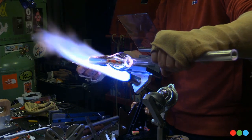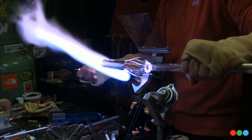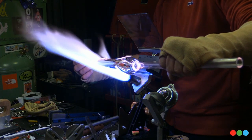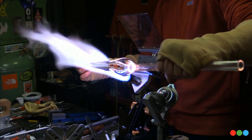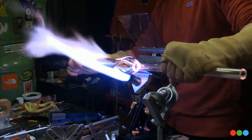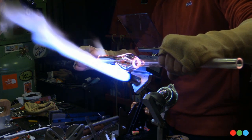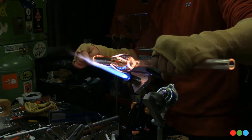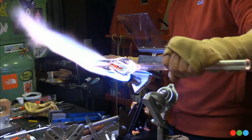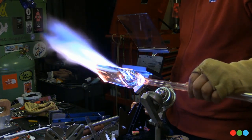Once it's encased, you need to wipe that clear off. While it's still this big fat bundle that you've now made solid, you can at that point carefully do a quick wipe and get that clear off until it's just color on the sides. Or you can just cold work each chip, which is just the tiniest little bit of clear, so it's kind of just a quick zzz, zzz on the pad, on your lapidary wheel or whatever.